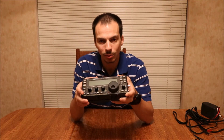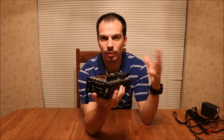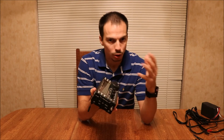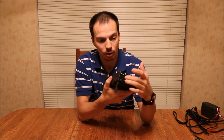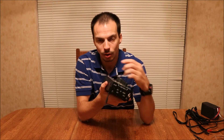Max power is 15 watts if you're putting in voltage from the external port — I think you've got to put 11 to 12 volts to get 15 watts out. I do have the battery pack in it; it'll take 8 double A's, rechargeables or alkaline, and you can recharge them through here. I have the battery charger built in, so it'll charge those batteries.